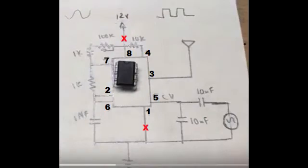Now if we go back to our schematic diagram, I like to check off the things I have connected on the breadboard. As you can see by the red X's, I've checked off the power and the ground from pin 1 and pin 8. Next we're going to hook up the jumper wires that don't really connect any resistors or capacitors — just simple wire connections. So let's take a look at that.